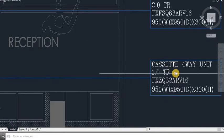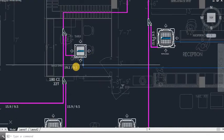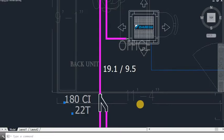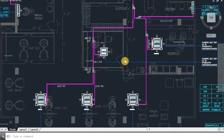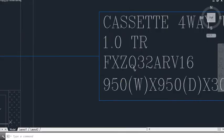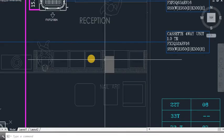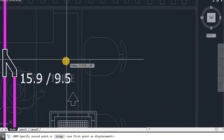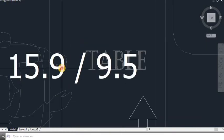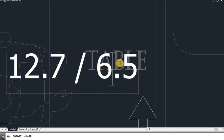This next unit is 1 TR with CI of 32, so we take 31.25. Looking at the chart for CI 32, the pipe size is 12.7 and 6.4. The total index for this branch will be 32.5, so I am going to put 12.7 and 6.4 here.